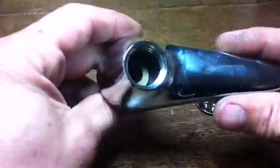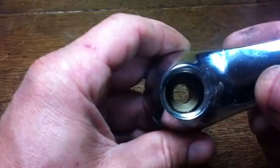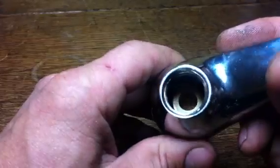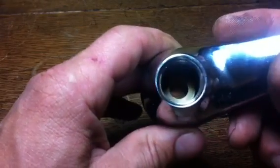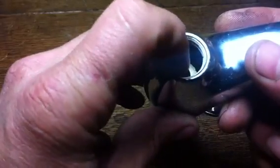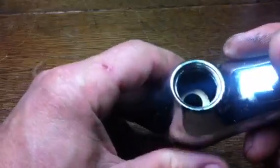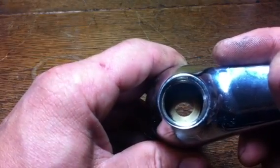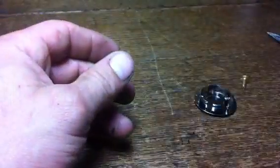Now, there you've got your base, your tap. What you're looking for in here is, you see the seat there? You're looking for marks, erosion, cracks, splits, etc. If there are, you can reseat it. You can get a reseating tool, about 15 quid, screws into that bit, and then it just cuts away and straightens out the seat. But in fairness, you only want to do that if there's a real problem. You can't change the taps if it's a set of taps that's matching, or things like that. But anyway, so there's your base, your valve base.